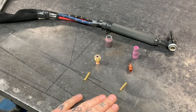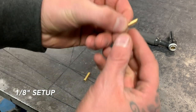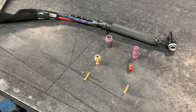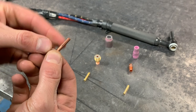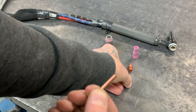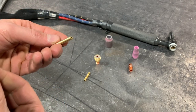I usually run one of either of these sets for AC aluminum welding. This one's the more typical set that I will run. It basically has an inner collet sleeve — I prefer the wedge collet type. The other type of inner collets you can run are split wedge collets. Unfortunately, over time the heat from your torch causes these to warp really easily, so I would definitely prefer to choose the wedge collet type.